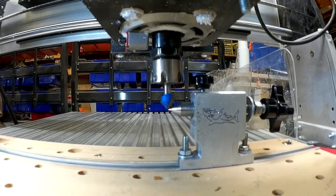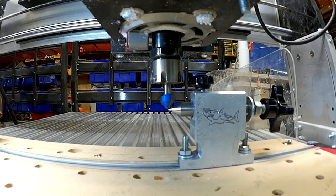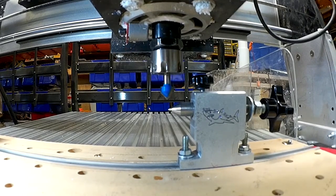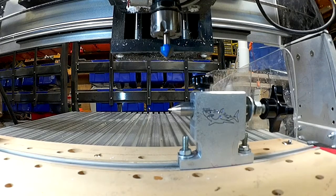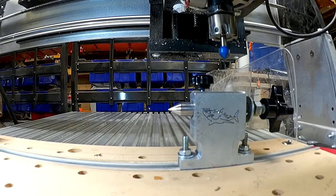So what I'll do is because I have mine on a board, I tighten my board down now so it stays in place. Now, my Y is always parallel, okay? I again look at X, or I look at Z, which should be at 0 right now, which it is, and that is at 0. Now what I'm going to do is I'm going to pick up on Z, and I'm going to go over and touch off on the tailstock.